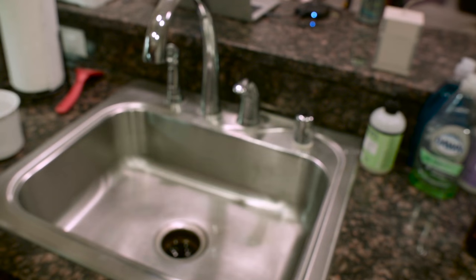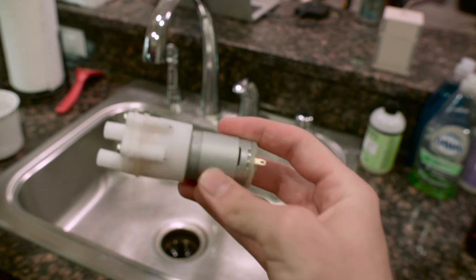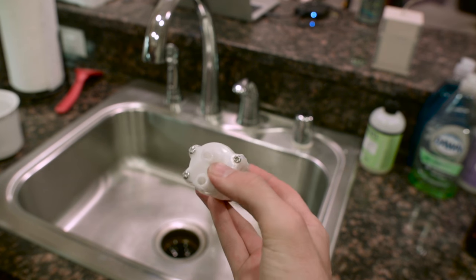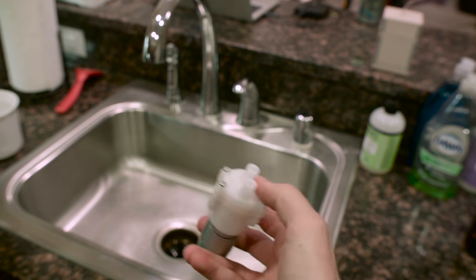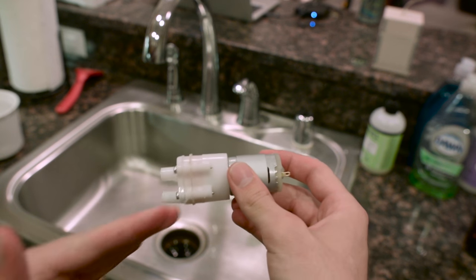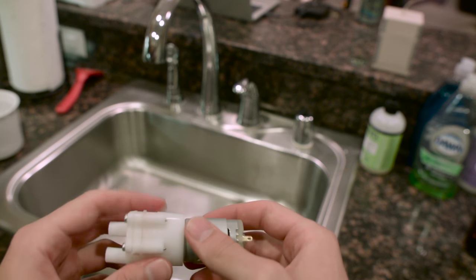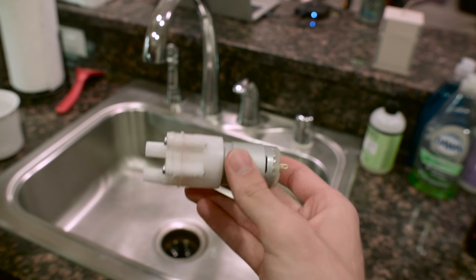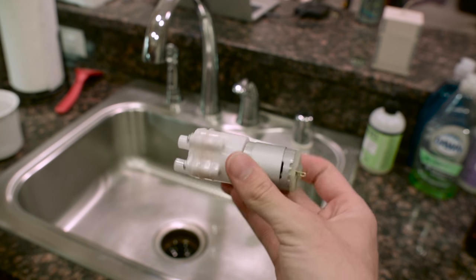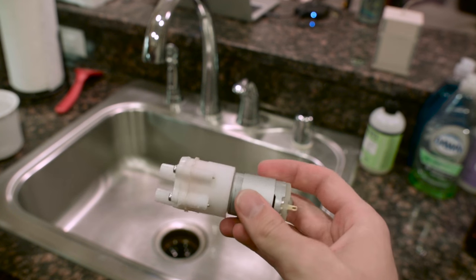One last thing before we end the video. We picked up these pumps on Amazon. And we think that these will work much better than our pressure system. These are self-priming pumps. So what that means is you don't have to submerge them in water. You can start the pump out dry, take fluid in, and then it just comes out this opening right here. And a very high flow rate. So we're thinking we could potentially hook this up to some sort of flow gauge to precisely measure the output.